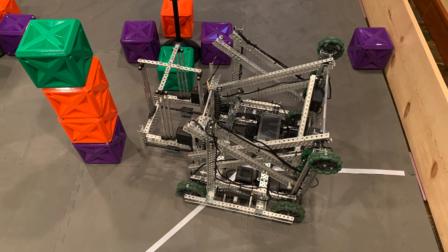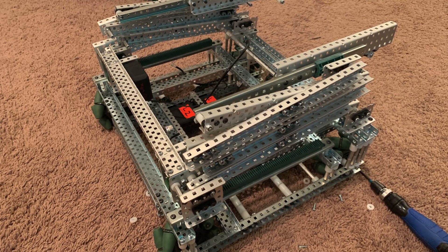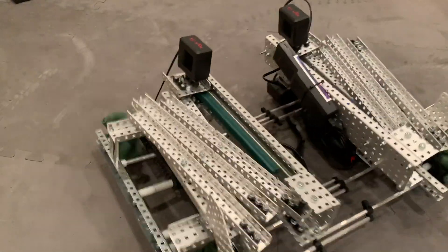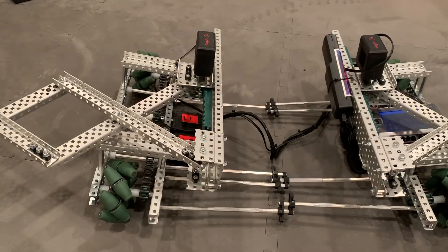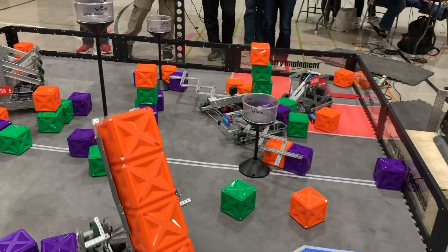Oh boy, the wallbot. We tried to build another double reverse 4-bar, but due to me taking 14 college credits and scheduling conflicts, this robot just couldn't have the time put into it that it needed. As was beginning to be the pattern for this year, we built a last-minute robot to take its place. The summer scissor lift that had come with us when we purchased stuff from the school — we hacked it apart and built a wallbot out of it. We took its two mecanum drive pods and put standoff slides between them so it could expand, then took the scissor lift parts and put them on the side so we could expand with sort of wings. We took this bot to a competition and it didn't do amazing — we did well enough to pick, but ended up getting knocked out.